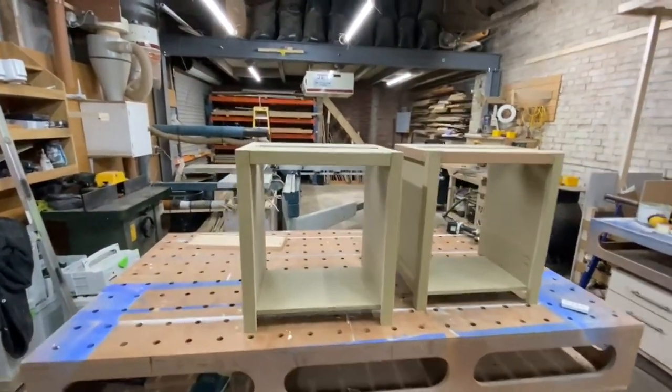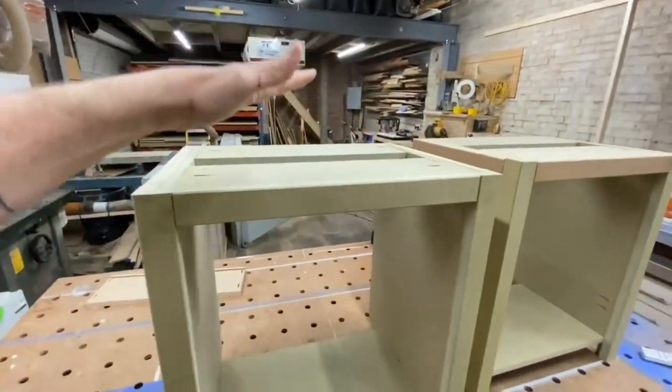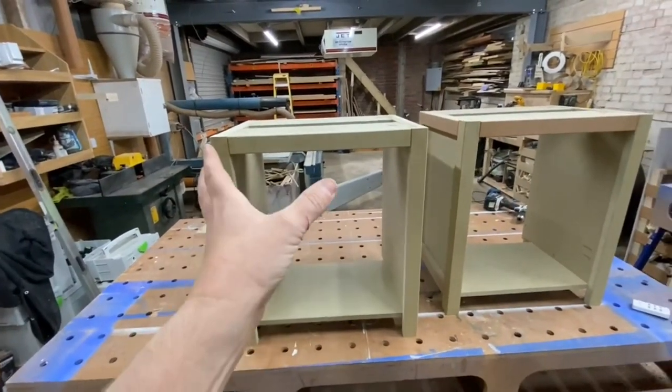They're ever such a straightforward build. I didn't film it because like anything I do, it is pocket screwed and dominoed, basically. I am looking at changing that system, but at the moment, for cost, it works well. And it's strong, and it's glued, it's a great system, really. So we've used 15 mil for all of the carcass material, and that's purely just to keep the weight down. And they're so small, it's strong enough.